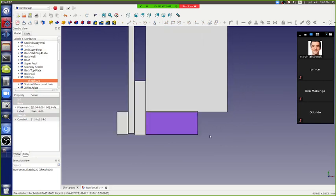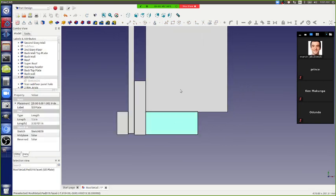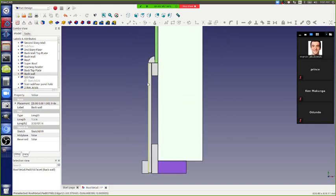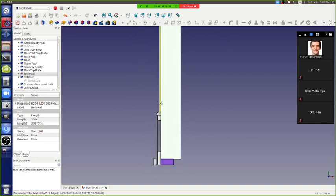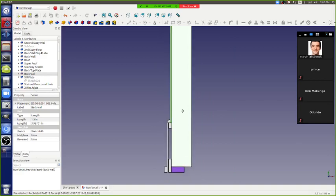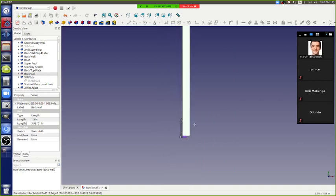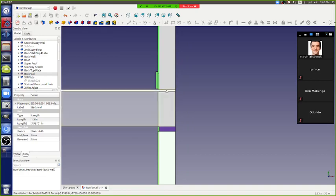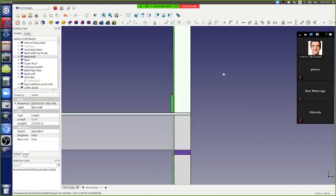This is on a foundation. So you've got the sill plate here, and the panel starts here. And you trim this all up here, so it's all good. That's the utility channel. You've got the interior plywood, and we use this, it's called quarter round trim, just to make it look neat. If you go up, that's your top plate. That's your second story platform. That's the OSB, the actual panel on the first floor. Then you've got your second story wall.